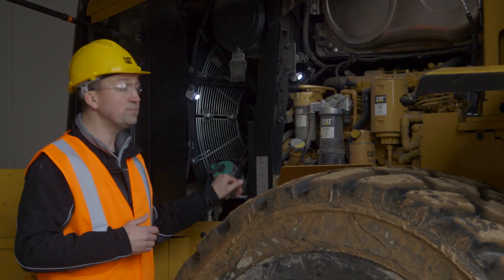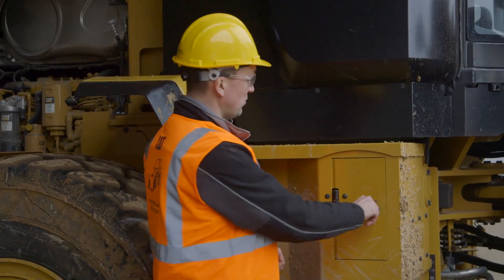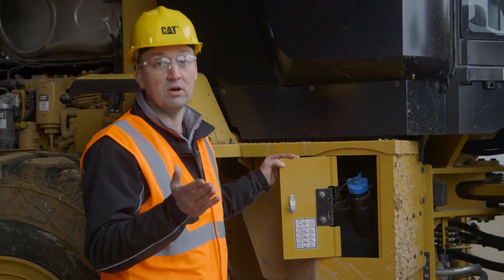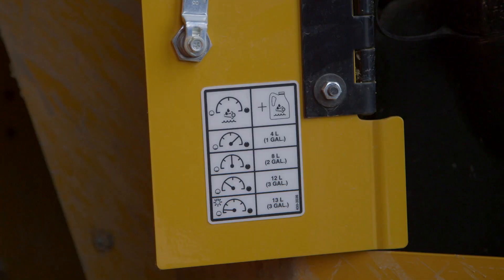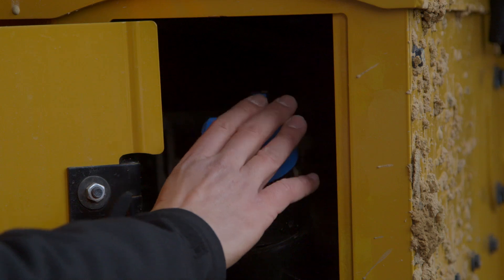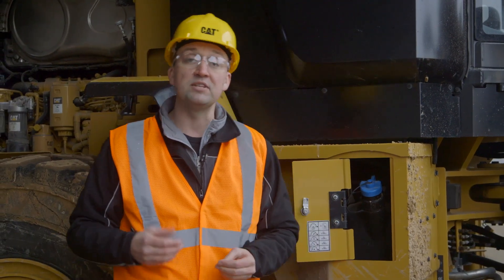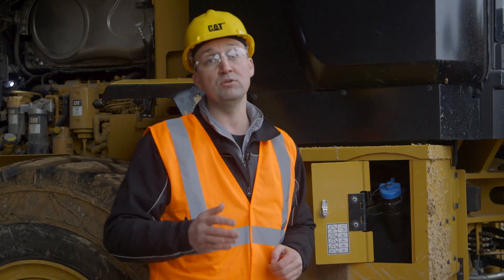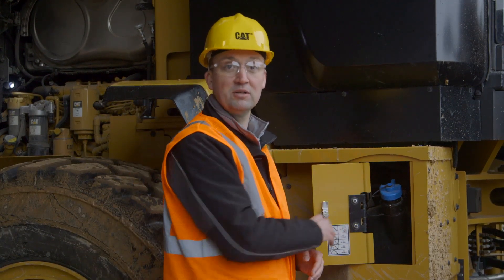You will have to put both diesel fuel and diesel exhaust fluid, or AdBlue, into this machine. You can run biodiesels up to B20 in this machine, but that's the limit. The diesel exhaust fluid, also known as AdBlue, fill port is going to be right here on the same side as the diesel fill. As you open this panel, you'll notice a cheat sheet. Before you get out of the cab, you can look at your diesel level and your diesel exhaust fluid level on the primary display, which tells you how much AdBlue to put into the tank. Testing has shown that the diesel exhaust fluid burn is about 2% relative to the diesel burn, meaning every 4th time you fill the machine full of diesel, you're going to have to top off the DEF.